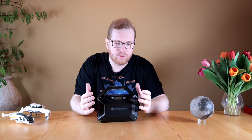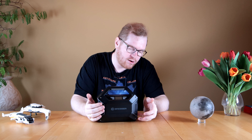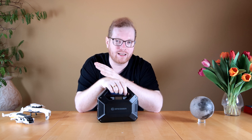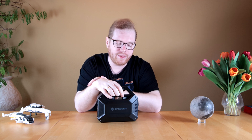It has 155 watt-hours of total capacity. In terms of astrophotography use, a typical mount will draw around one amp at 12 volts, so this should give you roughly 12-ish hours of tracking time. We're talking about pure tracking here — not slewing. So if you point at a target and plug this in, it should be able to power your mount for around 12 to 14 hours.